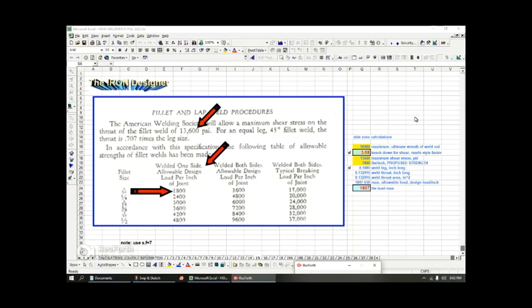You see, with all the weld failures and weld issues and weld imperfections that we have, we really can't look at such tight decimal places in our engineering designs. We've got to think high level and apply safety factor. That's what we need to do. So if 70% is your throat compared to your leg, then what I did over here to the side is assume that the electrode metal strength is 50,000 PSI. So your base material should be comparable in strength, also like a 50,000 PSI base material, and their chemistry properties should be similar.